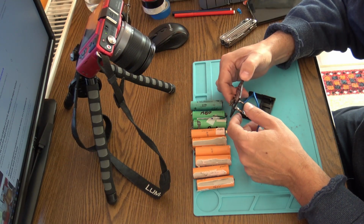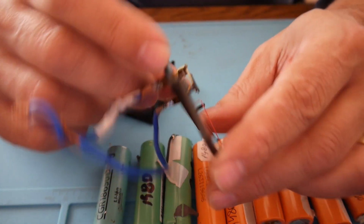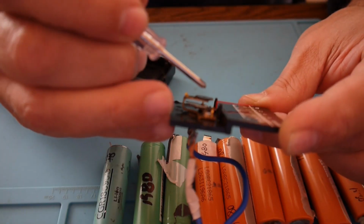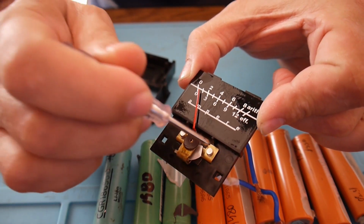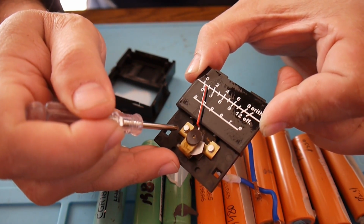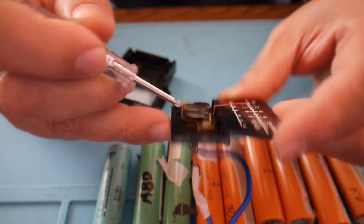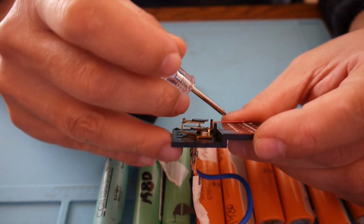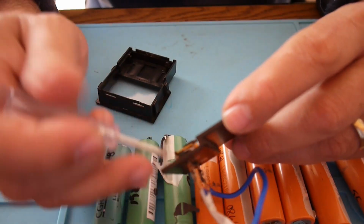And what I want to show you, and this is so fun, it's a very simple instrument. I thought we should have a kind of coil. There is no coil. There is basically a U-shape, this one here. First of all, the current is coming from this connector to the other connector. So this whole piece here is a low resistance resistor, and we have this U-shape here. The needle is absolutely free. It has two thin legs, I may say, keeping this in place. The whole measuring stuff is coming.